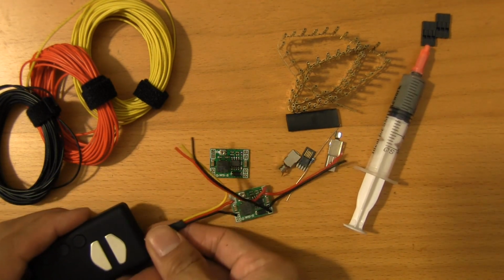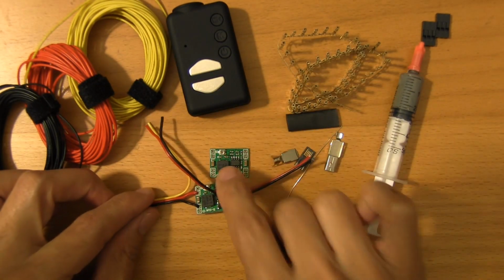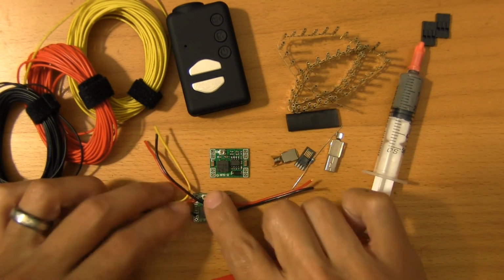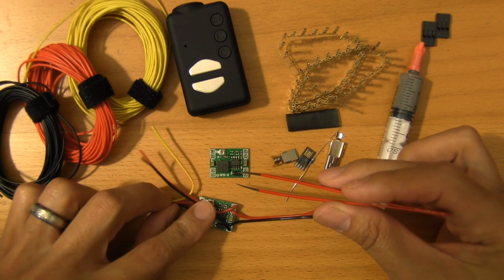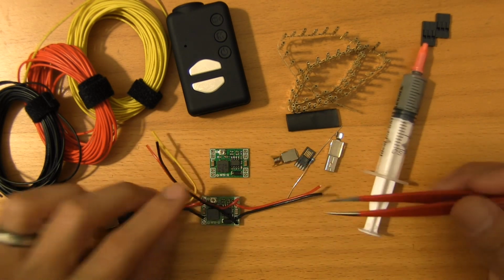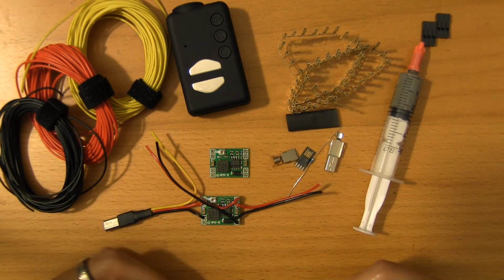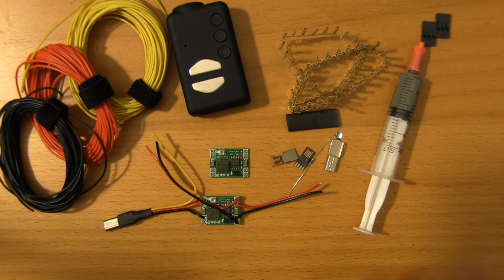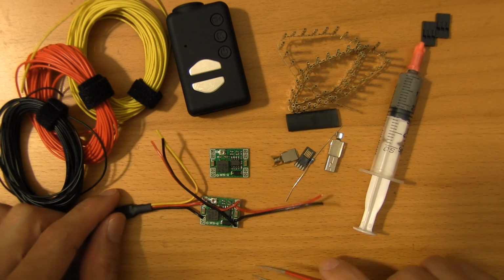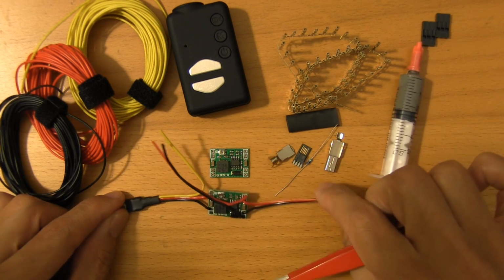So anyway, these regulators were really fantastic, and again, for $2, I use these for just about everything on the rig. For those of you interested in the UHF scans, we're talking millivolts of ripple, as well as a switching frequency down in the single-digit megahertz range. So these are fine on the UHF. They scan clean on the UHF frequencies and any of the other frequencies of concern. So these are pretty great.